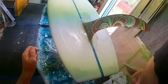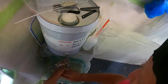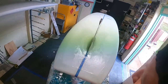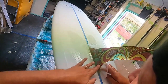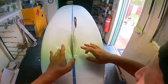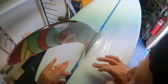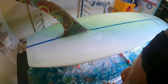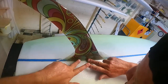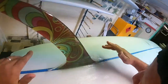Pull off the little strandy bits — looks pretty darn good. Clean it up a bit, and hopefully it should gel. The biggest problem you have is bubbles in your rovings — I've gotten rid of that right from the start. Through the middle, now going through the tail — work that out in the tail. See how there's no bubbles. Beautiful. Now go forward, same thing. This is starting to gel already, it's starting to warm up. No bubbles here.